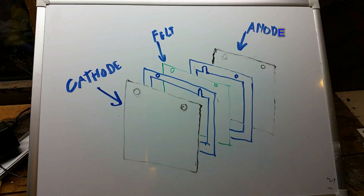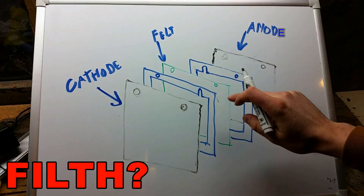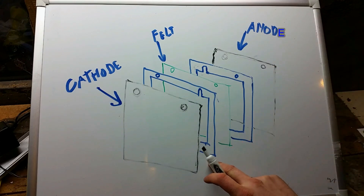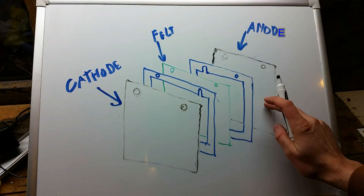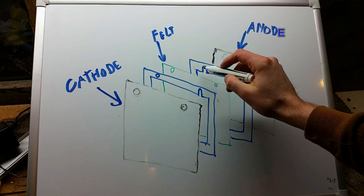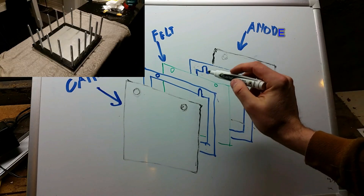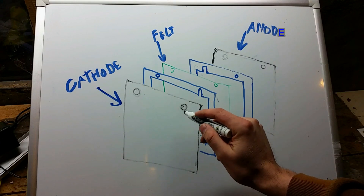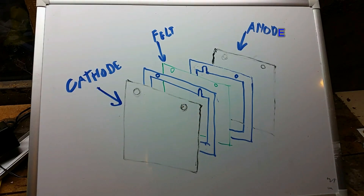I made an exploded view to explain. We have the cathode, the anode, and my membrane — which is a kind of separator. The hydrogen generated on one side can only flow through a dedicated hole. Because it's all stacked together, you get one channel with openings only on that side, so through that channel only hydrogen flows, and through the other channel only oxygen flows. That's how they are separated. My generator has 10 sections like this.